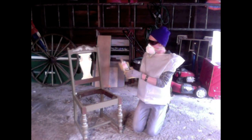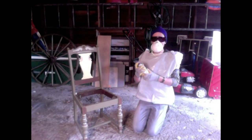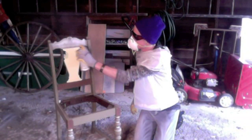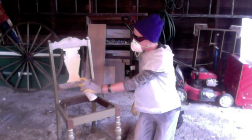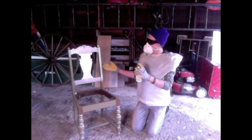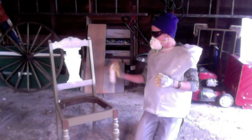As far as actually spray painting, you're going to want to hold the can about a foot — 12 inches — away from whatever you're spraying. Think of it like hairspray: you don't spray right onto your head. Hold the can a fair distance from what you're painting, then just push the button. Another thing to keep in mind is to keep the can constantly moving, because if you hold it in one place for too long you'll get a lot of drips and runs, and that's just not a good look.